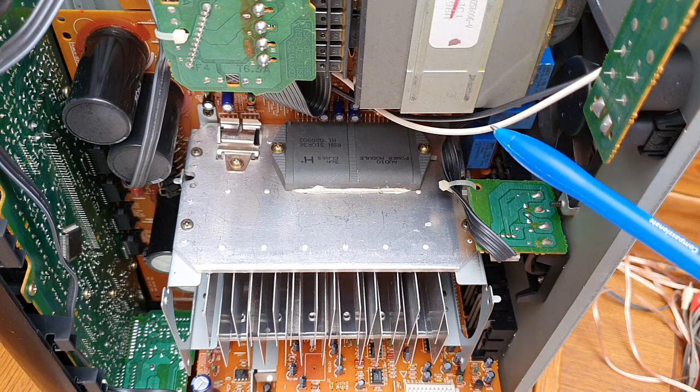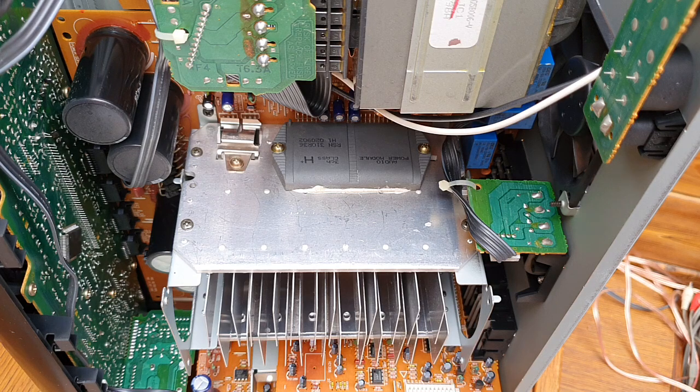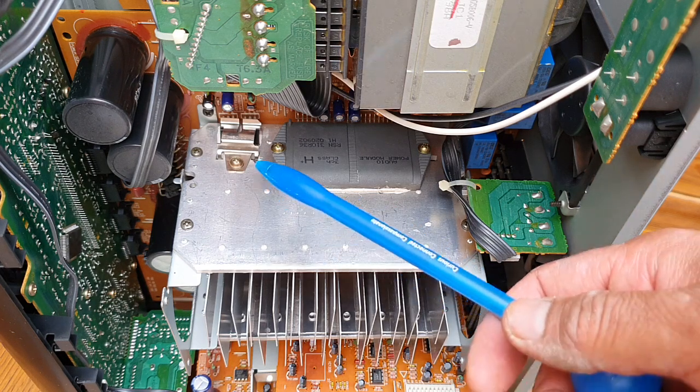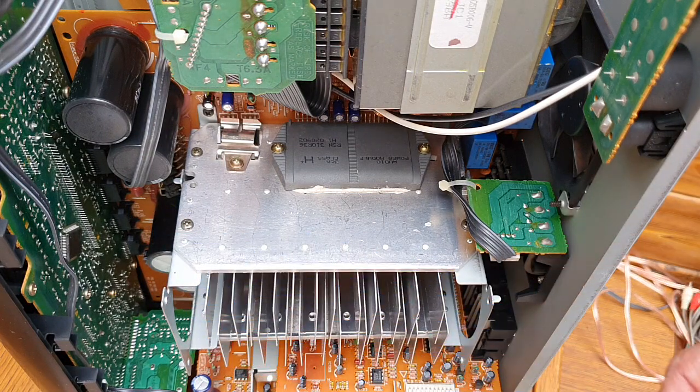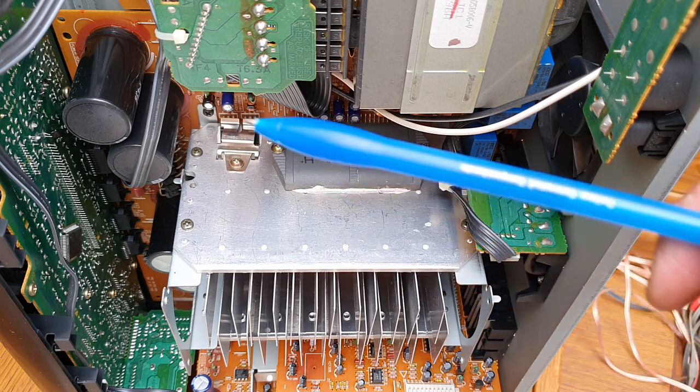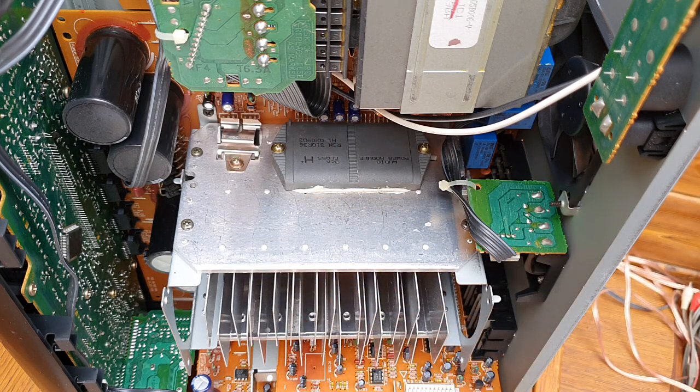A bigger power transformer is not the only sign of good amplification. You also need a good chip for the driver mode and selectivity, like I mentioned, digital signal processing by DTS and the Dolby system. So you have to take into consideration all the inputs and the capability of converting audio into a digital signal and returning it back. So if you just see an amplifier is heavy and you think it's good, it's yes and no. You have to research a little bit the circuitry and the architecture and the capability to deliver the power output. These things you have to take into consideration.